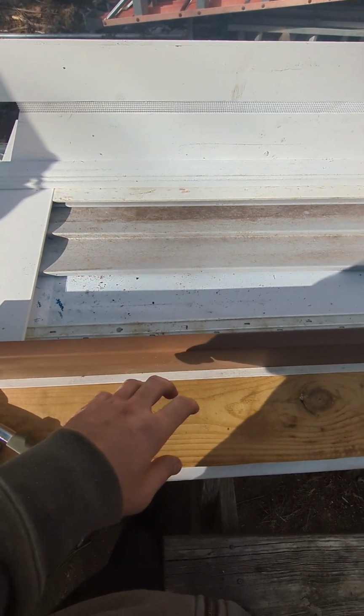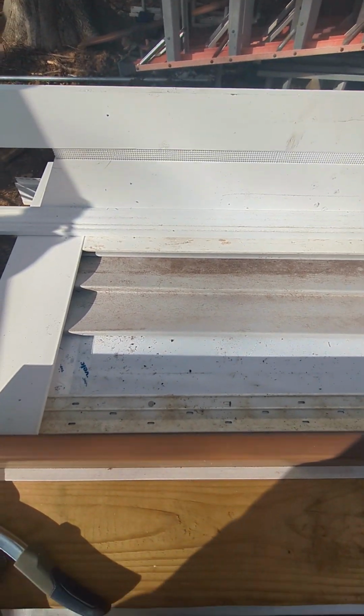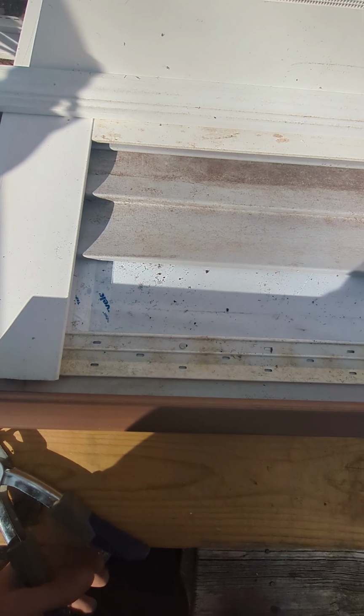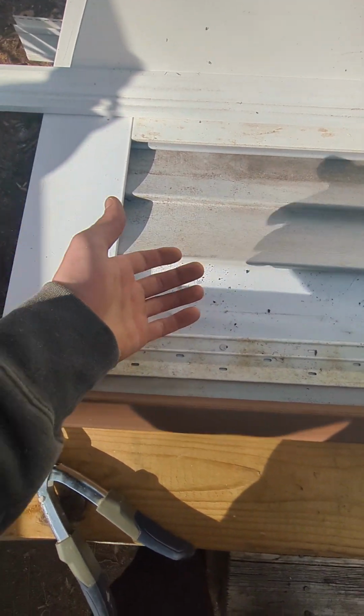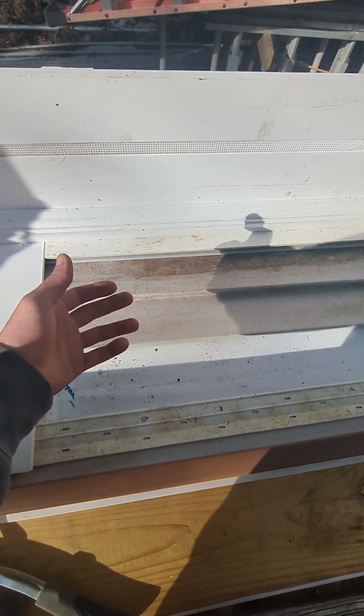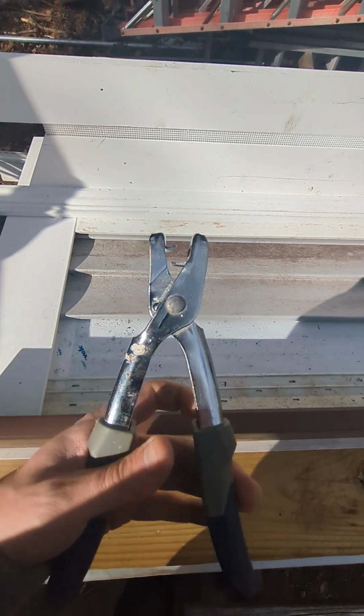And look at that. You're all the way from your deck ledger or your water table up to your soffit with no J-channel, which is always the goal. Maybe you learned something, maybe you didn't. Some white ledger cap, pre-flanged corners and trim, pre-rabbeted frieze boards, nice clean core vent, maybe just the crimper for the finishing strips.